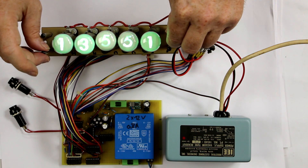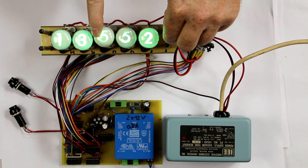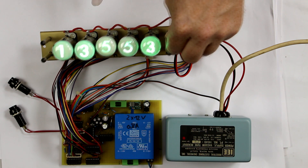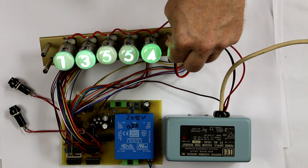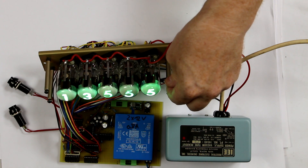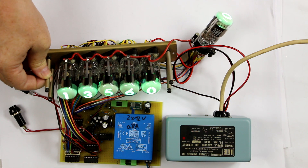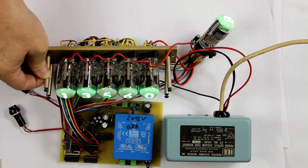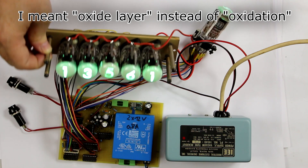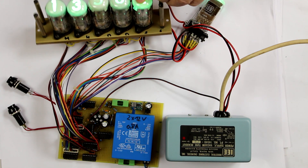You might notice, if I dim the lights, that these two have a little bit of ghosting, but I think this is due to a bad anode voltage connection. I noticed this during testing — the little pin that comes out of the tube on the side, which is contacted with a spring contact, has some kind of oxidation, or I'm not sure how to call it correctly. I have to clean this up, or perhaps dry some of the other tubes. This sometimes goes away when I wiggle the tubes a little bit.